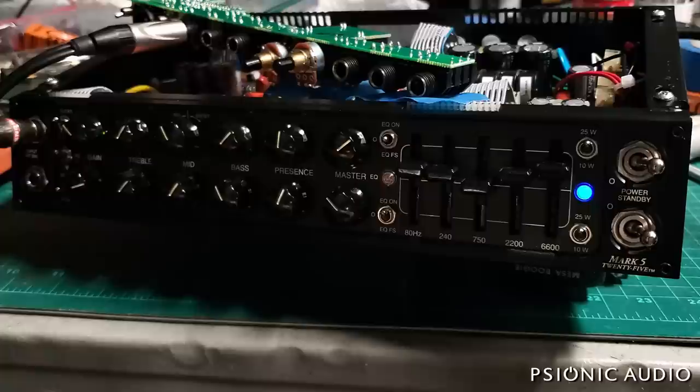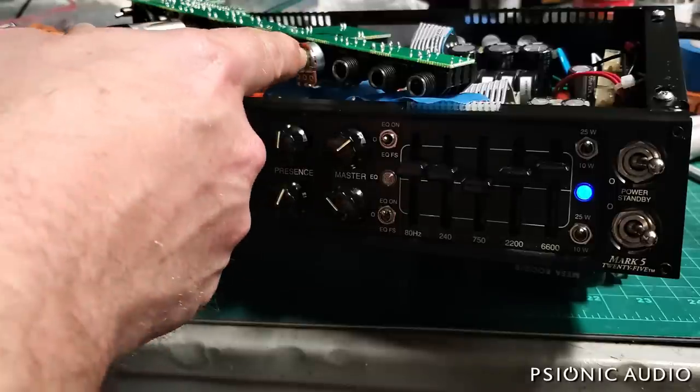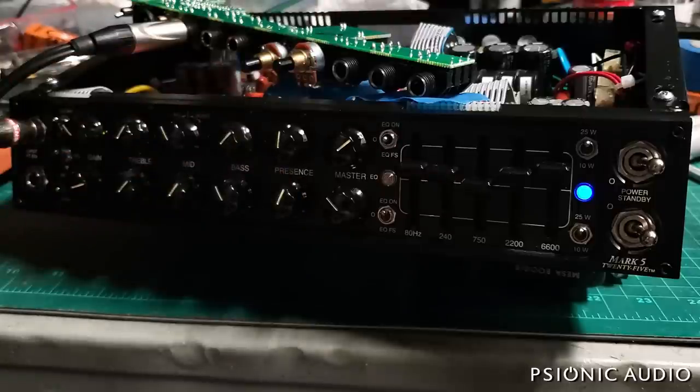So either there is a fault in the reverb circuit, could be that tank thing they got there, the little bitty tank. I think it's likely that there is some part of the reverb circuit that has to be tied to chassis, and it is not at this moment. This is up in the air. There is a little section of bare metal on the rear panel. The rest is all covered in paint that makes contact with these two pots. And for all I know, that's also being used somehow to complete the reverb circuit. So I'm going to put this back together in just a minute, at least partially, and see if the reverb returns. I did try a different tube.